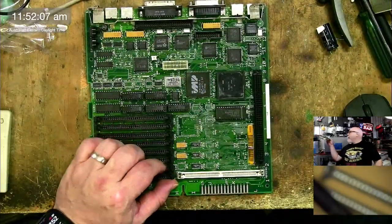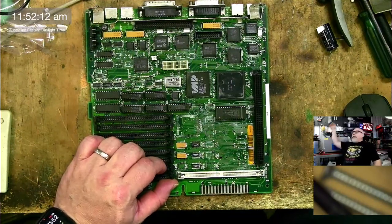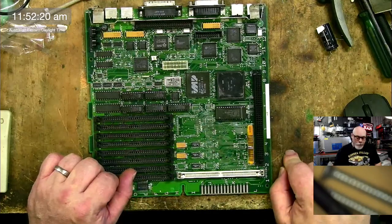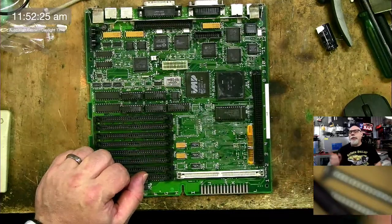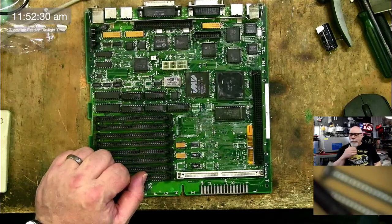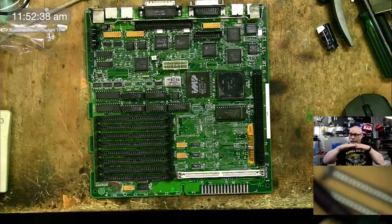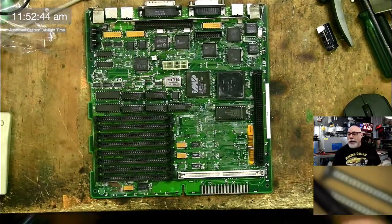Shady Robot, hello there. So what we basically have remaining of yours, Max, this is off the top of my head, so it could be wrong, I have a 2FX here that still needs a little bit of work. I've got to get the schematic out and do a little bit of trace checking around where the damage is. I believe that there are some vias that have corroded all the way through, and those vias are connecting with layers in the middle. I've just got to find out what's not making connection. So that is the plan.